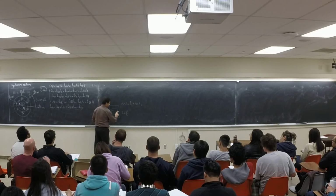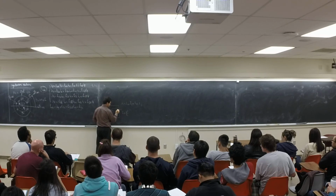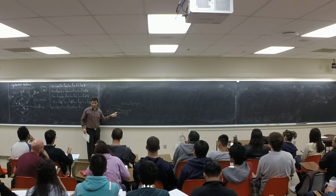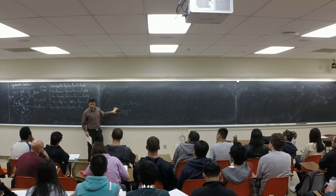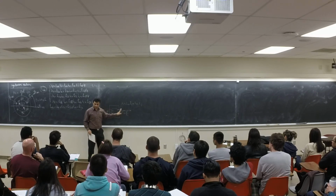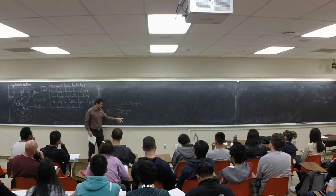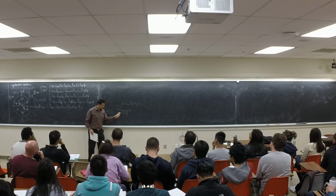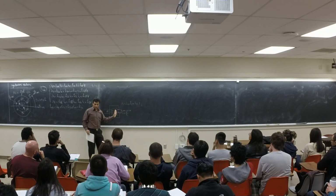But for example, let's say you have something like this, and somebody can pull this one. Now R is different. R is variable, because if this one goes here, the air gap area is going to change. So basically, this is a variable reluctance, and L is not constant. L still is N squared over R, but R is based on where we are located.